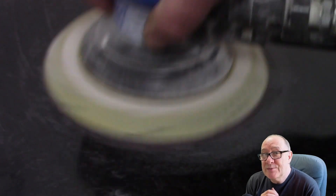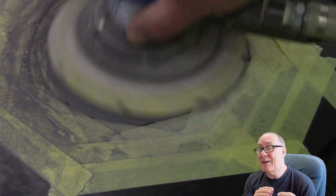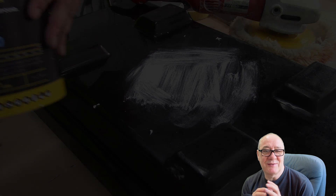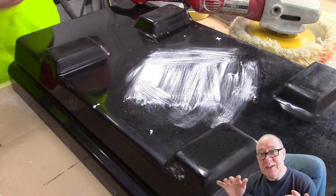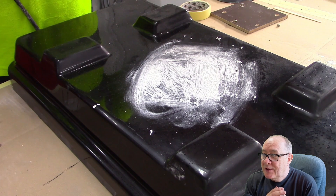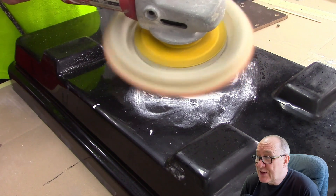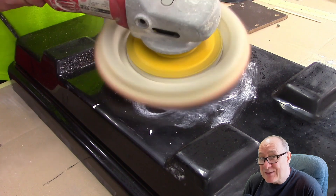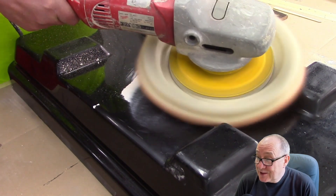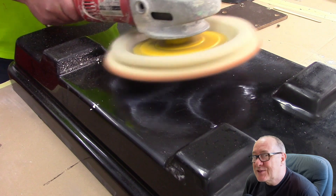You can surround the repair with masking tape to protect the original gel coat as much as possible. It's worth noting that even though we're using gel coat, there's very little chance the new gel coat is going to match the colour of the original, because your original gel coat has had however many years of UV damage which will have faded it — so it's never going to match 100 percent. After polishing, the patch of gel coat we applied will most likely contain tiny micro bubbles from the mixing process, which will show up as tiny micro craters as we cut into the repair. Degassing the gel coat in a degassing chamber before application might eliminate the air bubbles but it's not really a practical step for a DIY job.